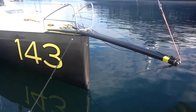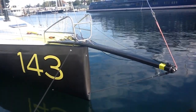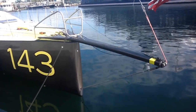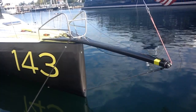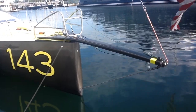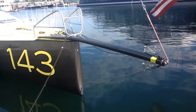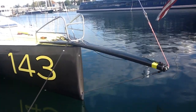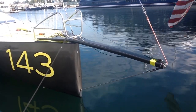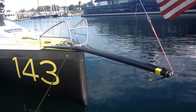A slightly higher volume bow than on previous boats, with the stern flattened out accordingly. This should make the boat really quick reaching without adding too much wetted surface. She's a kind of hybrid between generation three boats and the very latest transatlantic boats — powerful enough but also slippery in light to moderate conditions. A really good boat for American waters and for European inshore offshore races like the Normandy Channel Race and Fastnet, which are often sailed in lighter breeze.